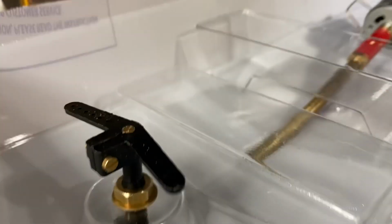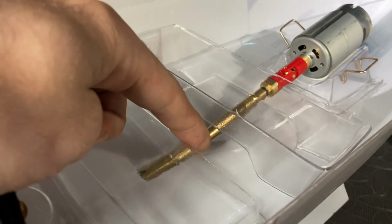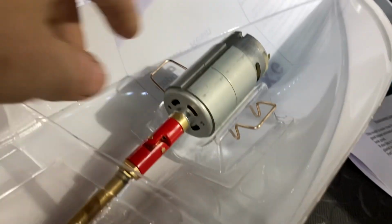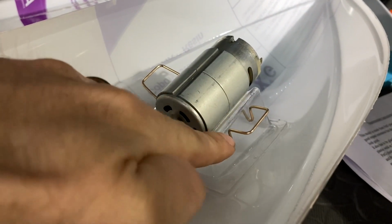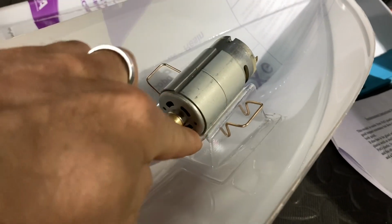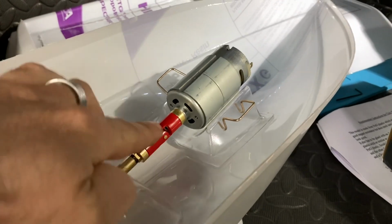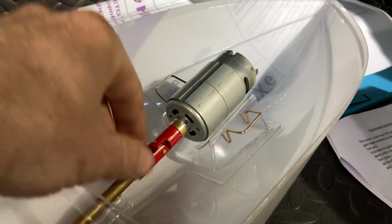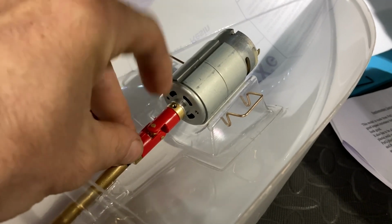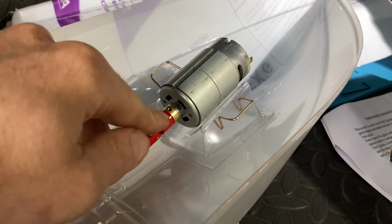That's also been mounted. I've raced ahead. Like I said, I've mounted the motor. That's stuck in place there now. Made these little hooks that you've got to make for your rubber bands that go up and over. I've got some 3M sticky tape on there at the minute holding that in place. This has been done as well, the universal joint there, and on the shaft for the motor I did add a flat spot so it's got somewhere nice to locate the grub screw.